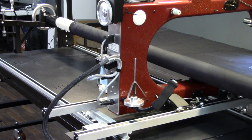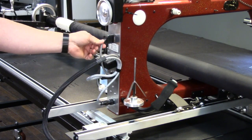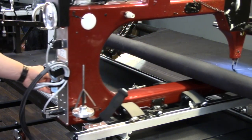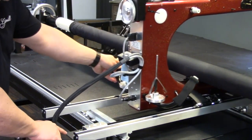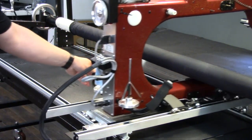There you go. With a properly installed strain relief, the wire harness will be entering the top of the clip. There's no excessive strain on our wire connections, and as you move the machine forward and backward, you'll notice that the cable harness never contacts any area of the cross track — so it doesn't bump anywhere — and that's very important.